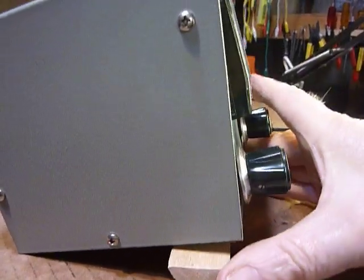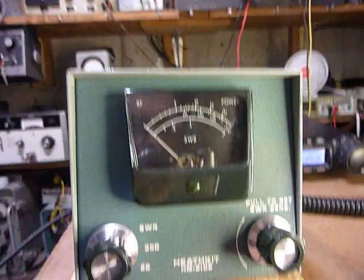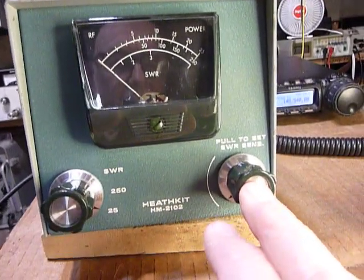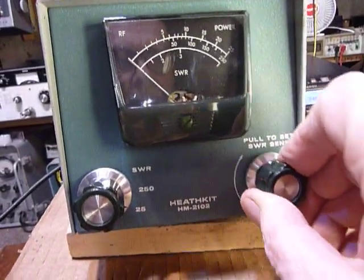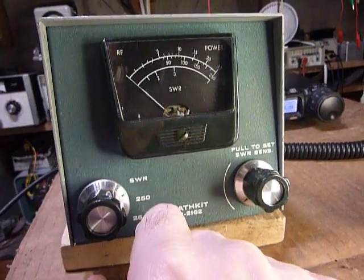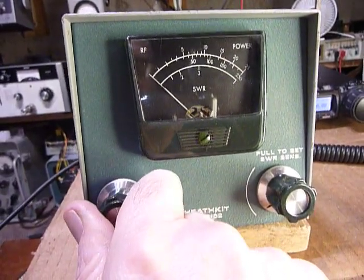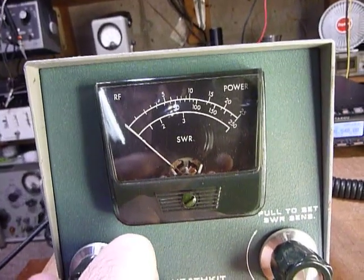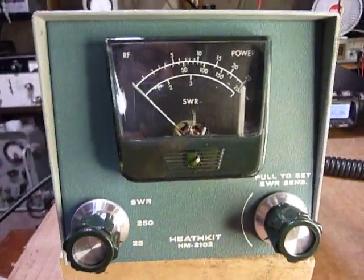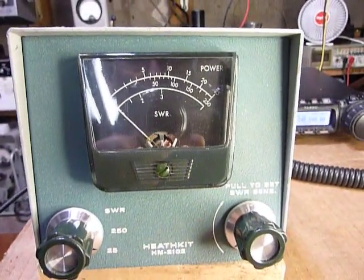Well, I've had this thing long enough — I should have known. I do remember now, but I forgot. The problem is there are two switches: one here, and one in back of this control here. It's a slide switch mounted on the control, and there's also a rotary switch with three positions. I got in there checking, and I touched this switch — it went right up to 15 watts. I touched it again and it dropped back down to 5. That's a dirty switch — it's got corrosion or dirt in there.